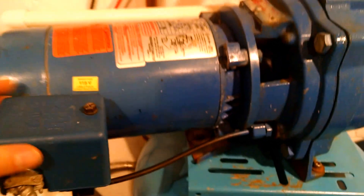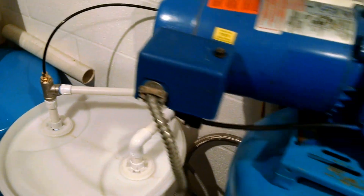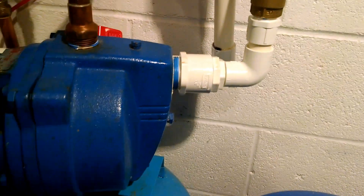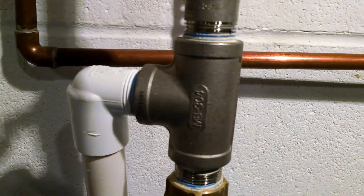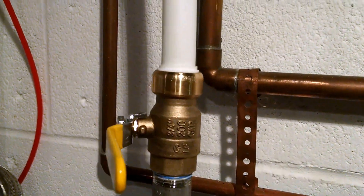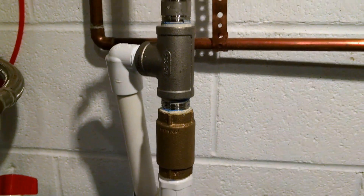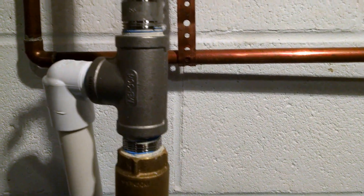The only thing that can happen to me now is if this overflows, it's going to go into the overflow tube, so that's no big deal. But if this barrel or the other barrel runs out of water, then the pump is going to pump nothing but air, and it would eventually probably get hot and shut itself off. So that's probably the weak point of this entire system. I've got a ¾-inch T stainless steel, threaded on all sides. This ¾-inch check valve is threaded on both sides. This is a ball valve threaded on one side and pressed on the other, which allows me to convert from PEX to PVC. All the nipples here are stainless steel. I don't use galvanized in any of my systems — it's got to be brass, stainless, copper, or PVC.